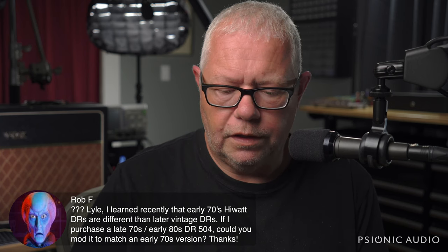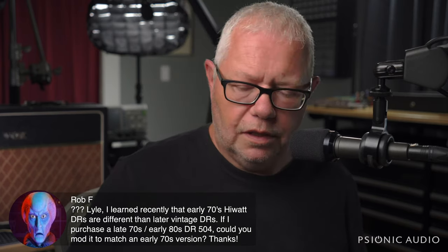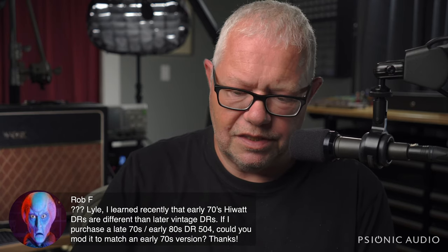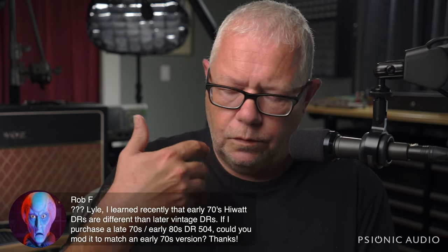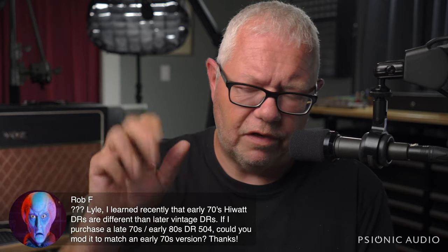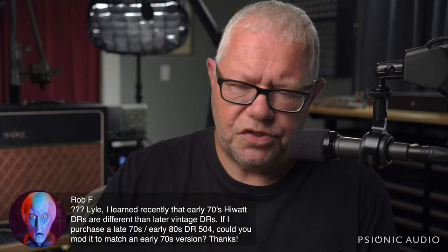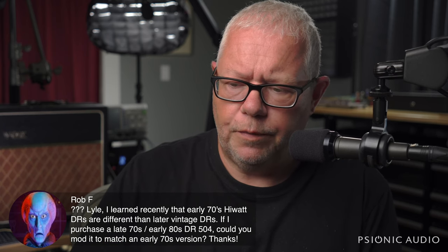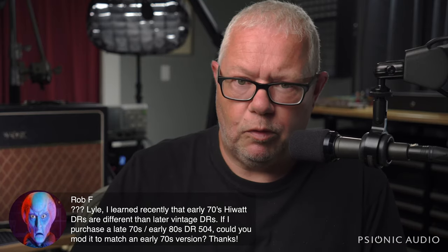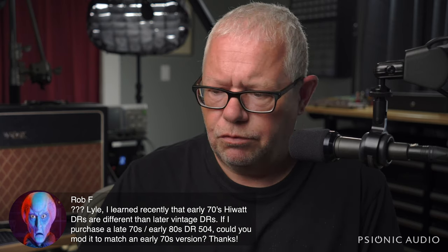And then you can make a judgment call, because I see this with the Silverface era Fenders. They have an amp that has problems because it's 45 years old, and they think if I blackface it, it'll magically make it perfect. And they've never heard the amp as it was designed. A lot of times, I go through a Silverface amp and reduce the lead length, recap it, get any conductive wax off there, shorten leads here and there to clean up the spaghetti, which I would have to do to blackface it anyway, fix the cathode issue on the reverb driver, remove the partial cathode bias resistors from pin 8 on the output tubes if necessary, maybe ditch some of the little snubber caps they put in there because they had so much wire, and let the owner really hear what a 76 Super Reverb is. A lot of times, that's a really good sounding amp, even if it's not an AB763 from 1966.